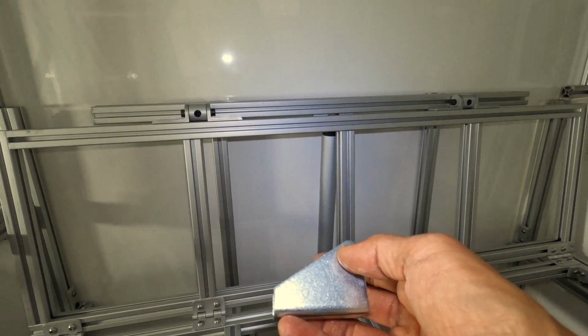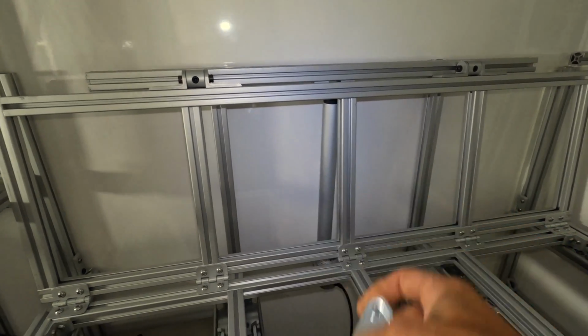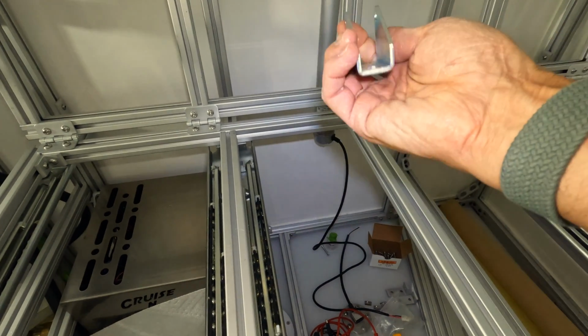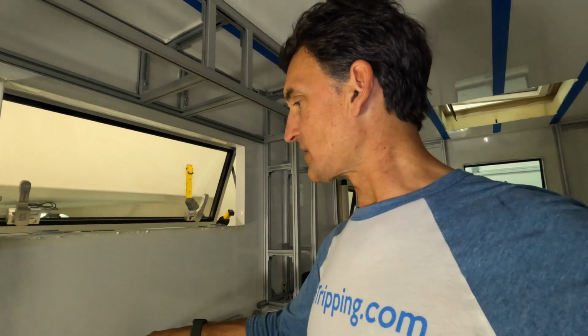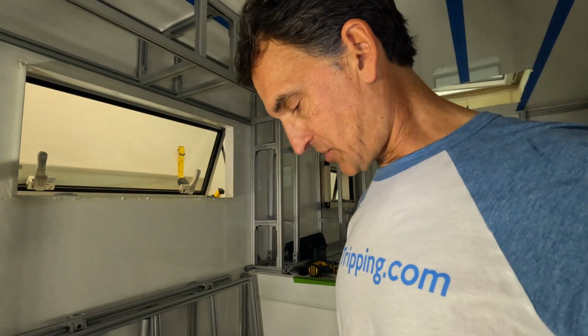This hole is about 1.5 inches from the bottom, so I'm going to put a hole about here, 1.8 inches. I'm going to slide this support arm over and mount this right to it, and that'll take care of it. It gives me a good solid mounting point and is at exactly the right height so that this tops out just right at the top and is pretty much flush with the front here, like how I wanted it. So it's looking good.